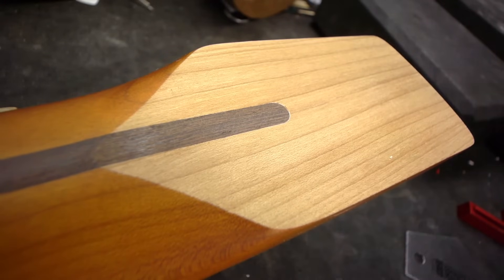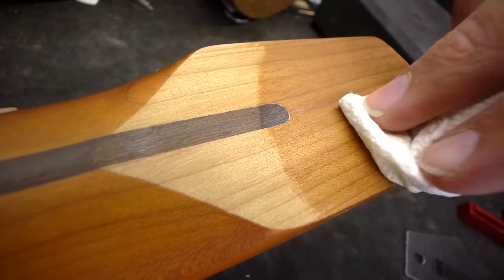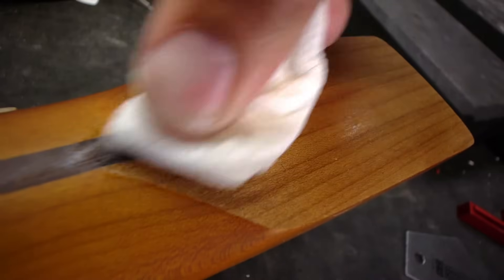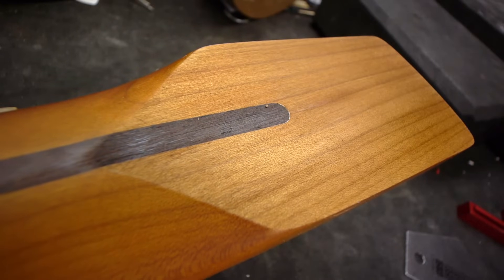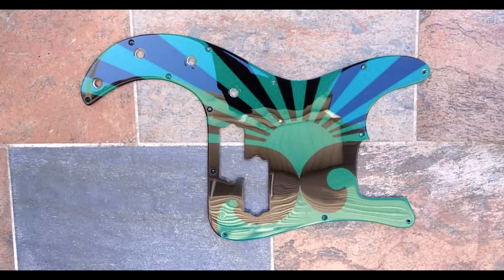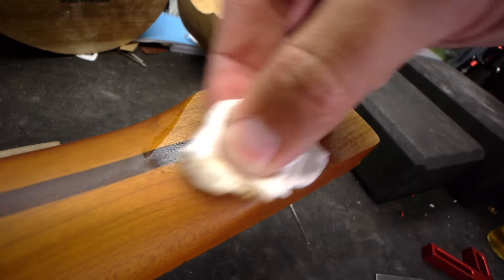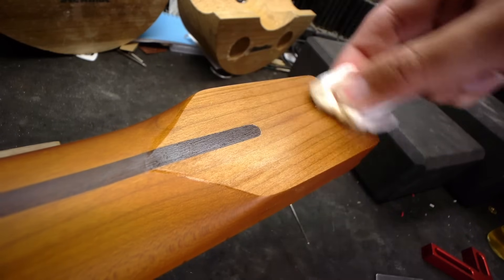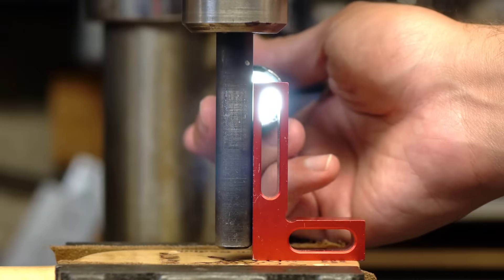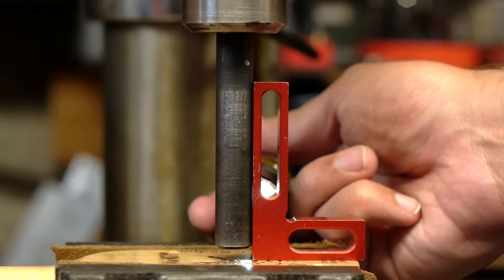To touch up the finish, I'm using some shellac I mixed up a few weeks ago — just put on a paper towel and apply a few quick coats to seal the newly flattened neck heel. Polyurethane or nitrocellulose lacquer with or without dyes to match the neck color may be necessary depending on the guitar. I now exclusively use hand-rubbed shellac: I mix it fresh with grain alcohol, making it completely non-toxic, easy to apply by hand, and it has a lightning-fast drying time. Once the uneven neck heel has been leveled, we're finally ready to move on with the threaded insert installation.